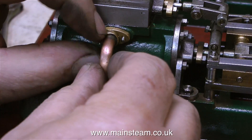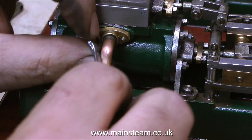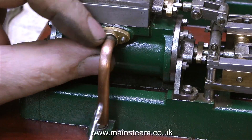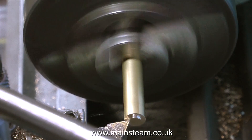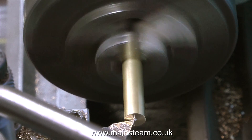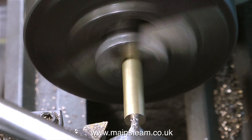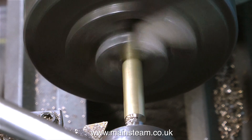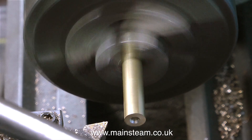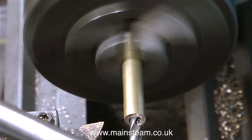Steam is an invisible gas, and it's very hot and very nasty if you touch it. What I'm going to attempt to do is turn these pipes round so that they're facing backwards. I also need a couple of unions so I can join these pipes onto another piece of pipe to take the exhaust to the condenser. I may end up modifying the condenser and bringing one exhaust pipe in either side. I need to shorten the pipe runs from the exhaust — the last thing I want is a very long exhaust that's going to condense the steam to water and fill up the condenser too quickly.